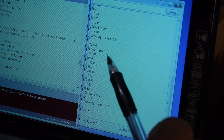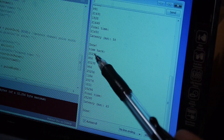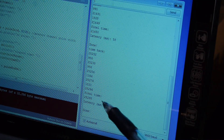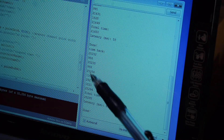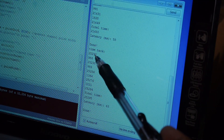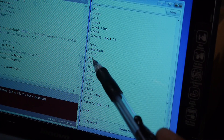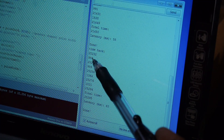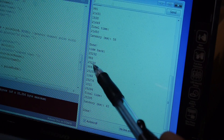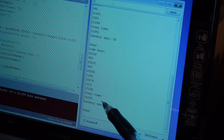I know it looks like a jumble of numbers, but what I've done is reworked the program so that once it sends out the initial pulse to the transmitter, it'll actually take several time slices until it reaches the final pulse width. The first number is the time slice — it's a relative number that just picks a time and says 'I started at this particular number of milliseconds.' The next number is the pulse width of the receiver pulse going to the servo. So what we have is: time, servo position, time, servo position, time, servo position, time, servo position — and then you get the final latency number of 63 milliseconds.